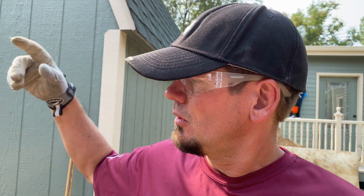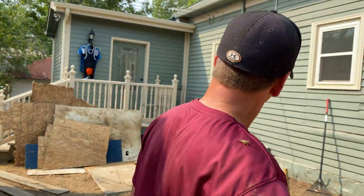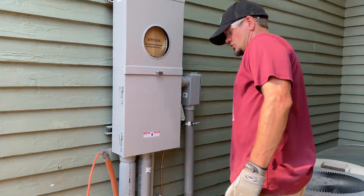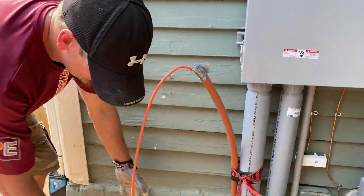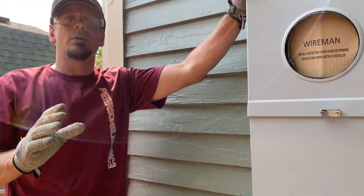They're going to push the sub feeders, and then we had a second inspection on the original permit to get power out to that garage. Now coming in here for the power, there was a two-foot foundation we had to chip out, and I had to use my heat box. If you don't have a four-foot heat box and a two-foot heat box, there's no way you're going to get away with this with Home Depot. So if the power company lets you bring your power in and you mess it up, you've got to re-tear it all out and redo it if they can't push through it.